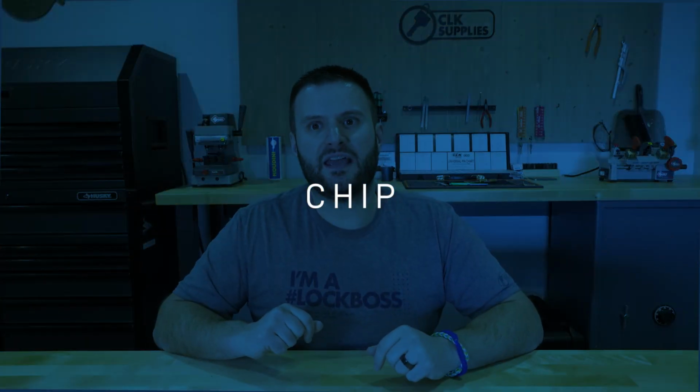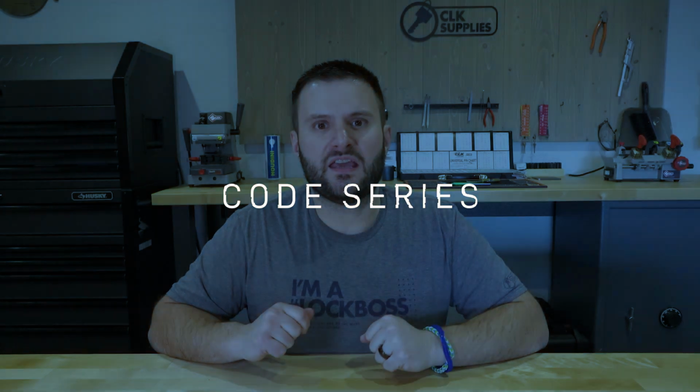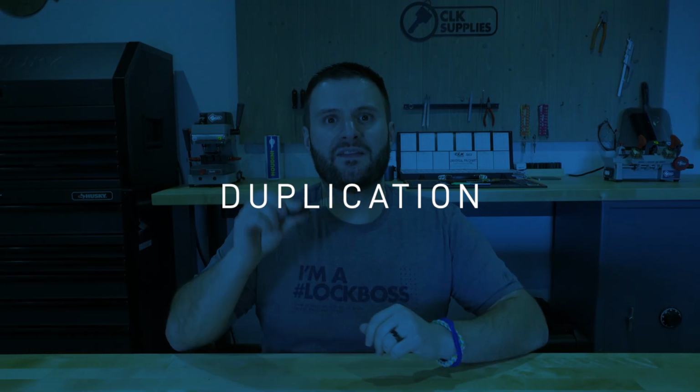So the chip, like I was just saying, is the Texas Instruments 80-bit 4D63 encrypted key system, the exact same chip that's in the H92. Now, when it comes to the test key and key shell, I recommend for both of them just stocking one part number, which is the JMA chipless key shell. The part number is TP00FO-24.P. Now, the code series for this key is 10001 to 11,500.